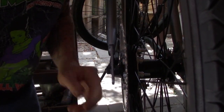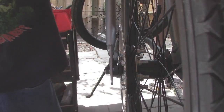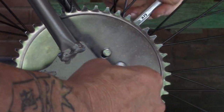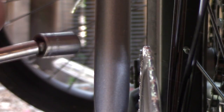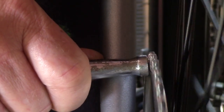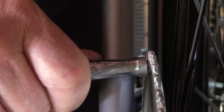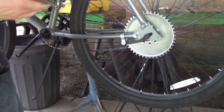What you're going to do is tighten up the bolts that are directly underneath the high spot. I like to choose three bolts - the one that corresponds to the highest part and a bolt before and after - and give them a couple of cranks, tightening the highest one the most. You're going to do this several times. Typically it's about three bolts that need the most tightening. Once there's very little gap left and the gap doesn't vary more than the inside dimension of the chain, you're good to go. If you find a stubborn spot, give it a couple of taps with a hammer.